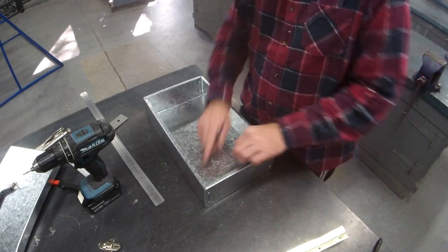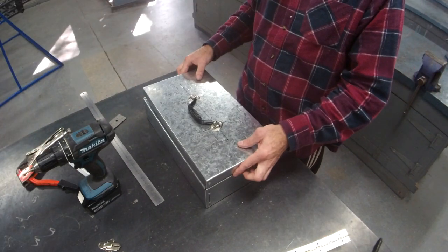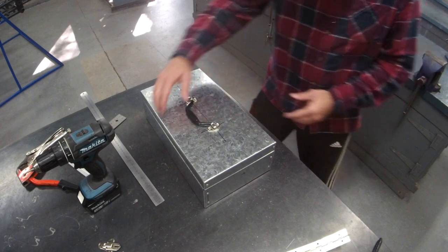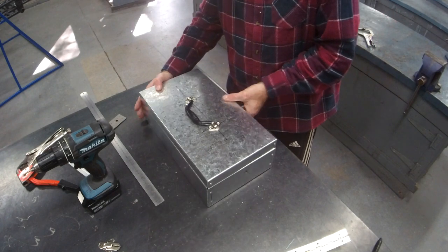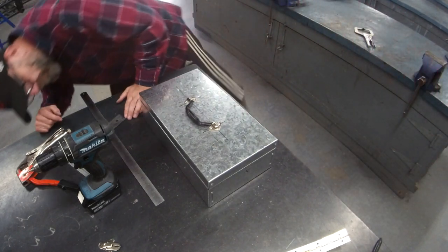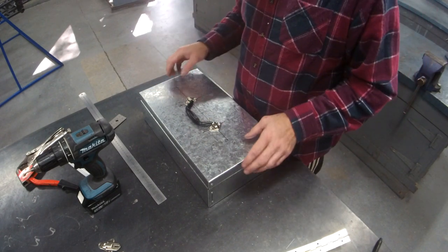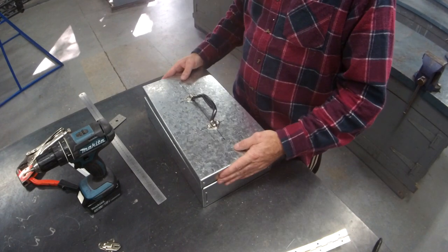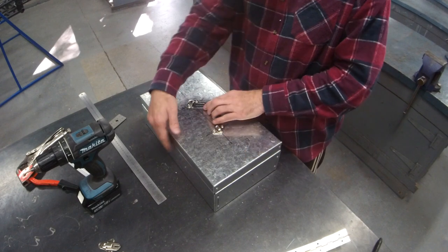Now I want to do the hinge. My only tip with the piano hinge, sorry, there's more than one. Put your box together and see if you've got a bigger gap, front or back for any reason. Have a little look. If one of them's got a bigger gap, this one's not too bad. But if one does have the bigger gap, because maybe these aren't perfect flush, put your piano hinge on that side. So this is pretty good, so I might put it there anyway.